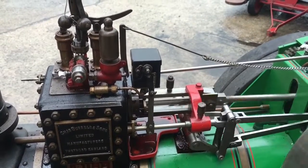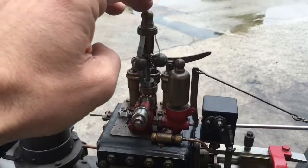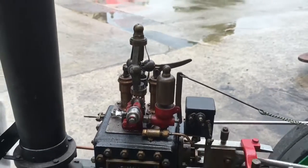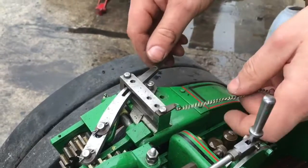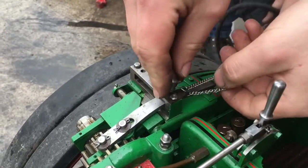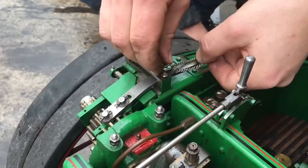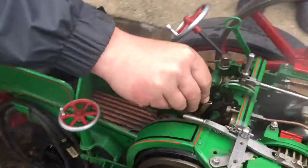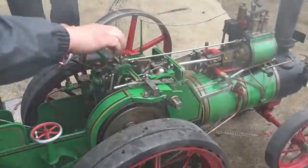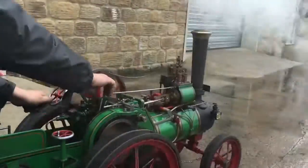The governor actually works, and when it's running you put a belt on and it drives. When you push that you can slightly hear that it's slowed it down. So this is putting it in gear — take out the pin, which is in neutral, and you can slide it across and then put the pin back in again. Select forwards, which is there, and then open the regulator a little. Before you open it too much, you can just spin the flywheel around, and then you're away.